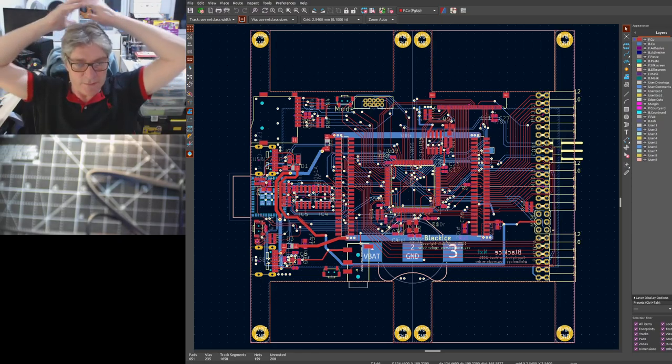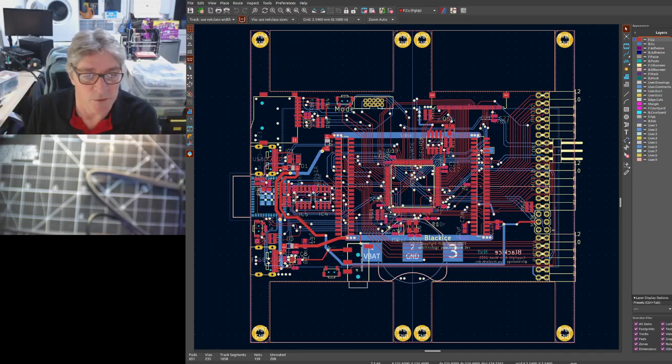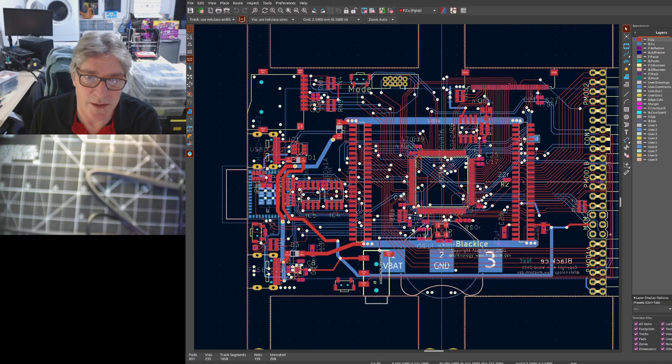The reason for doing this is very simple: to be able to offer a slightly lower cost version that has slightly lower memory performance. I mean, it's QSPI rather than Hyperbus. Secondly, the extra pins I use to add in, if you look here, an ESP32C3 mini module on the rear of this board, or what would be the top of the stack. And the reason for having that is I've then got Bluetooth and Wi-Fi connectivity.